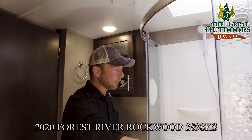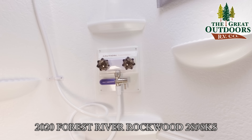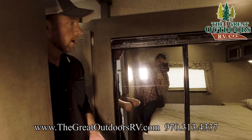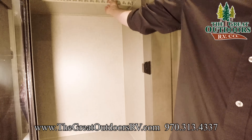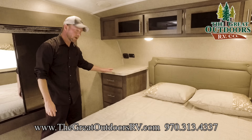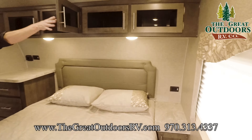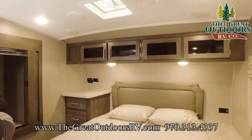One final thing before we leave the bathroom — the shower miser or water saver system. This is essentially a diverter valve that puts water back through the hot water heater until that little blue pipe becomes translucent, so you know your water is hot at the faucet. Then you flip a dial and the water comes out — it stretches out both your fresh and your gray tank. Now let's look at this really good-sized wardrobe closet that goes all the way across. I like the individual hanger hooks so your clothes don't slosh back and forth on turns. There's a good bank of drawers on the driver's side, a 12-volt USB outlet, a car lighter-style outlet, regular 110 outlets on each side of the bed, and some awesome overhead storage, plus all the storage under the bed.